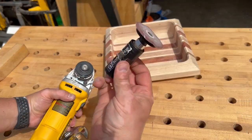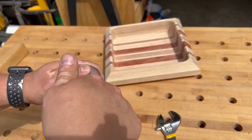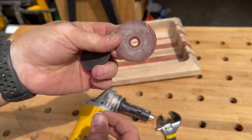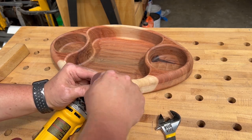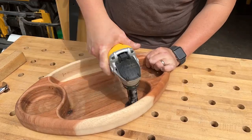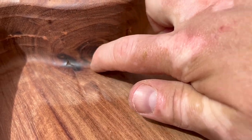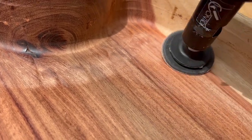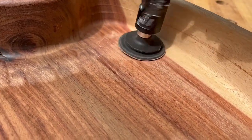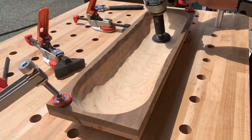Here's it in action — it really does just attach to any angle grinder pretty easily. To remove the sandpaper, you use a little Allen key with a couple of little inserts and then pull off the sandpaper. That silicone rubber is really flexible — it's much better than foam. To switch out for different grits, you take the pieces off, put them back on, Allen key in, and you're set. This is superior for getting the edges — here I am running the edges of a router tray, and you can see how smooth that corner is. The tool is primarily used with power carving, where it really contours well and lifts up into the corners. It just gives superior results — a great, great tool.